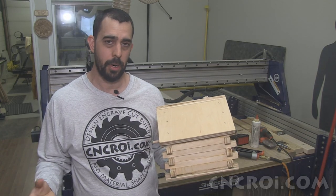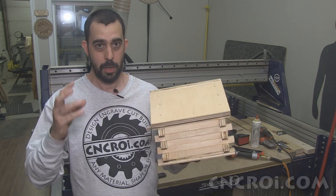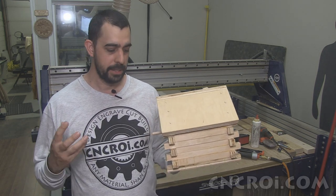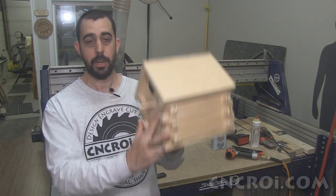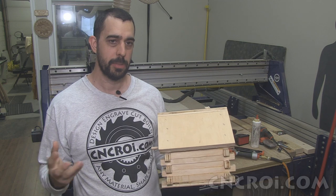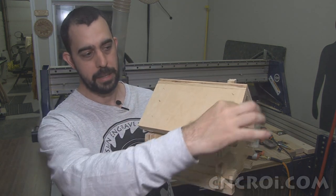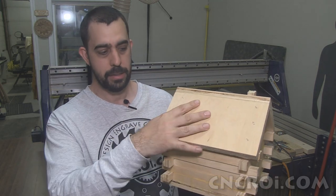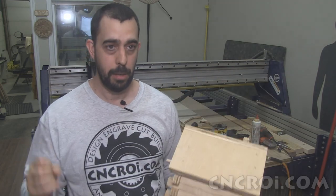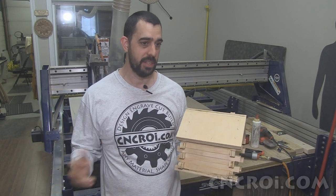Now, as mentioned before, our CNC router is a contact method, meaning the tool actually touches the material that it's working on. That's fantastic for a lot of applications. But when it comes to making stuff like this, you need to create support material. If I'm just cutting this out, I need to make something on the side to hold it in place while I cut other pieces. Otherwise, as you saw with the front part, it's going to fly off across the shop, because the router's spinning really fast and it doesn't stop for anybody or anything.